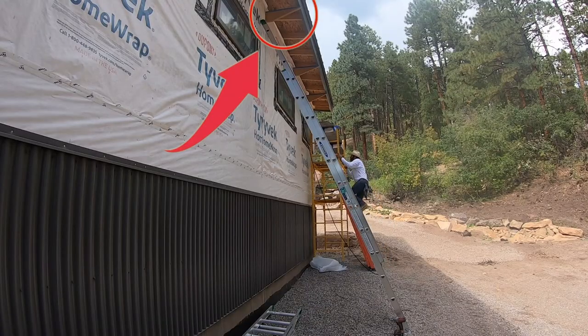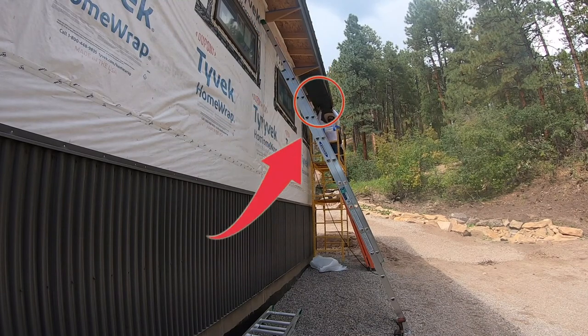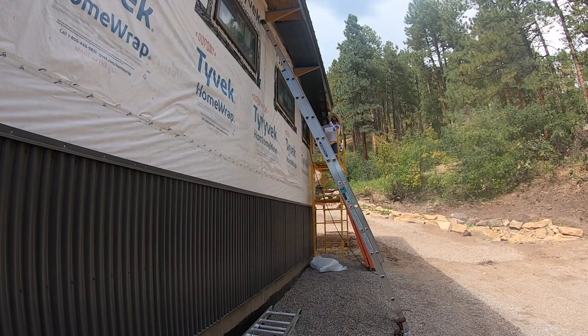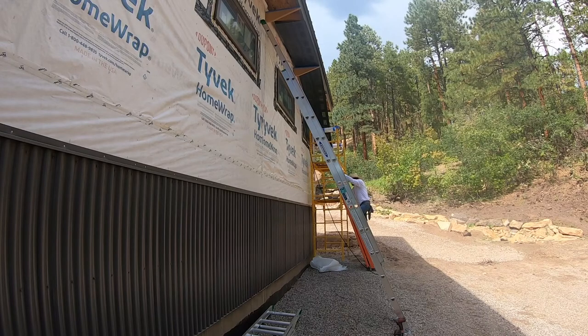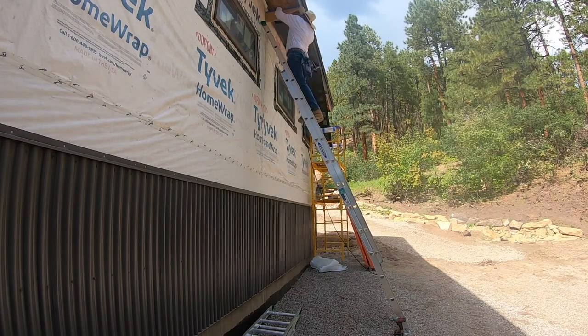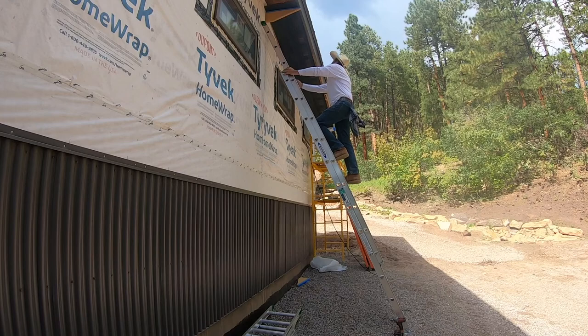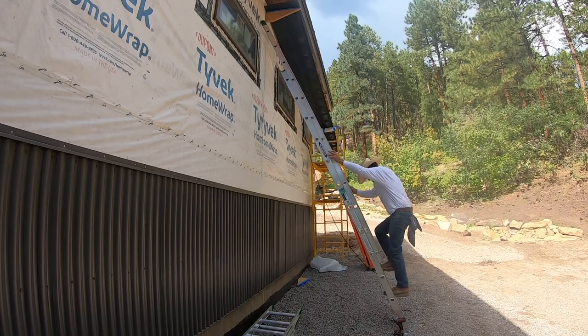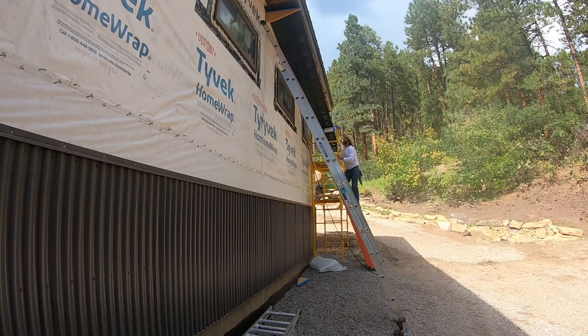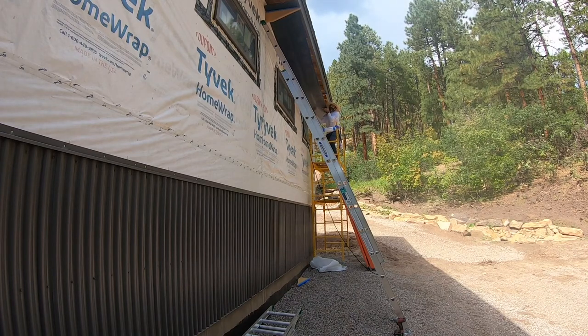The first thing I do is install three brackets up under the soffit, and then I use those brackets to slide the soffit material up over the top of them. I blue-taped the top of these brackets to keep them from scratching the siding. I did make a mistake in the beginning — I used too-short screws, and you saw that one fall off. I was using Kreg pocket screws and they were just too short. I did end up getting this piece up there okay though.